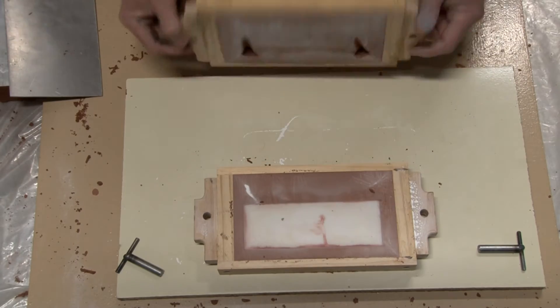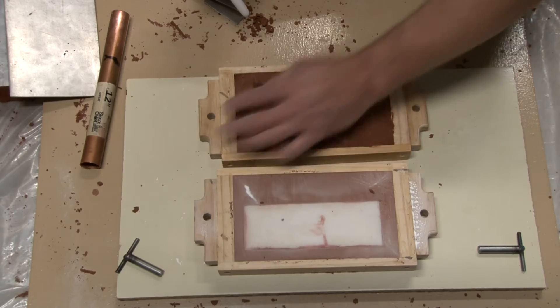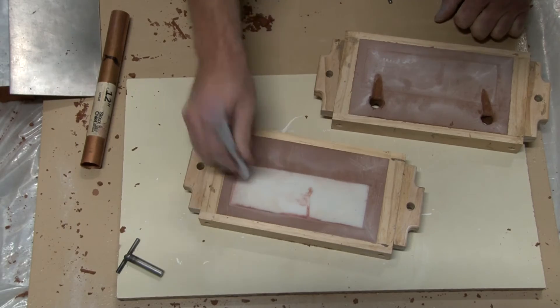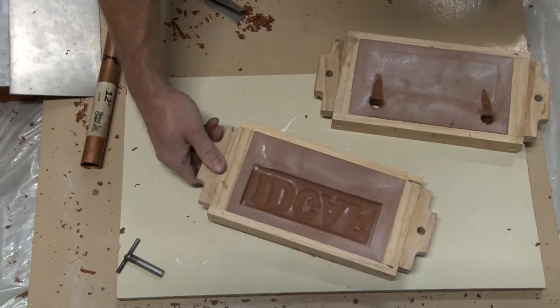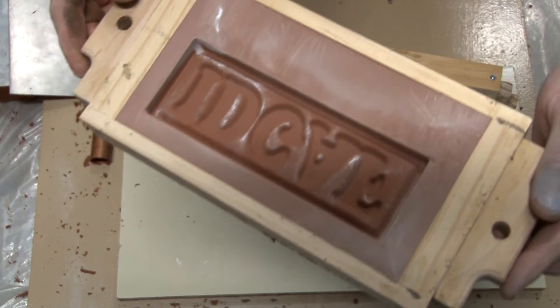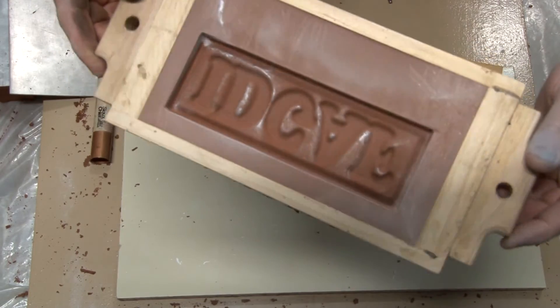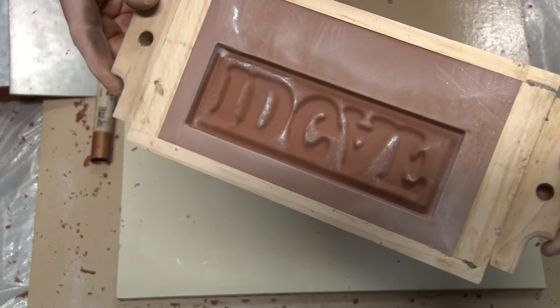One of the key takeaways in this video is to make sure you don't have any loose sand in your mold that could fall back into the mold cavity and leave pitting on your part. I use compressed air and really make sure there's no sand that's going to be mobile with the aluminum. I just wanted to slow down the video so you can see how smooth that turned out — aluminum has a pretty good chance of making a good reproduction of that.